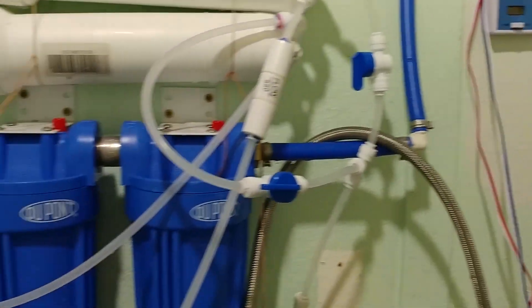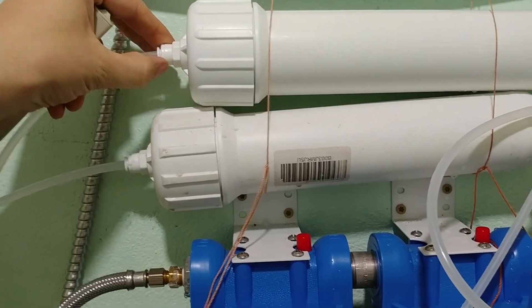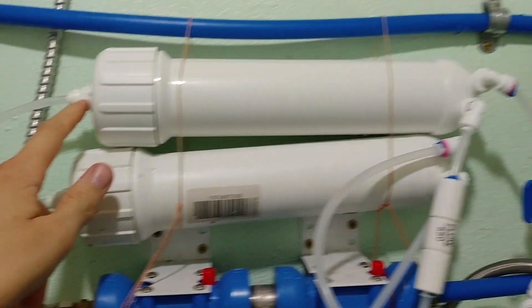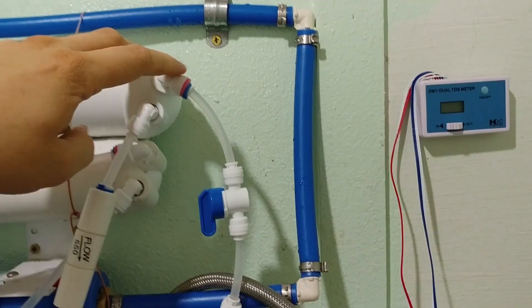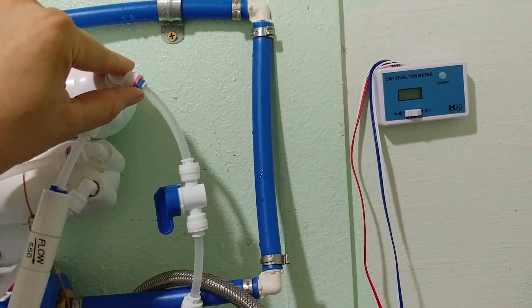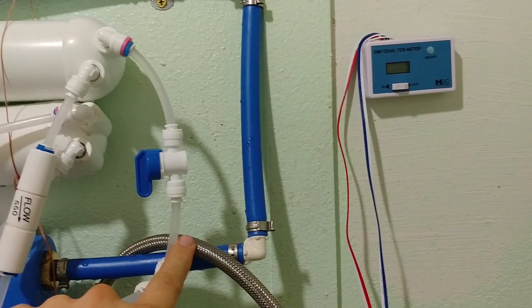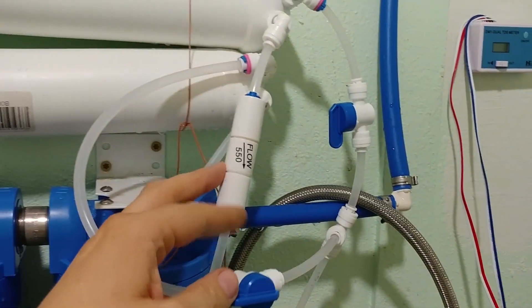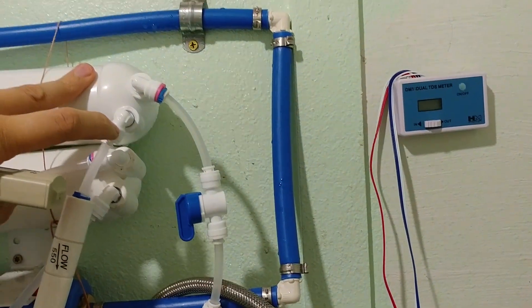The entire problem was just horrible stress because of my hard water. Running this system, I don't have to worry about it anymore. These connectors are all just push fittings — the base connector screws in, so you've got water in, RO water out, and wastewater out. You don't need the one-way valves if you're going to be mixing manually. If you're just going to run this out and pour it into a bucket, then turn the whole system off so you're not wasting 210 gallons of water every day.